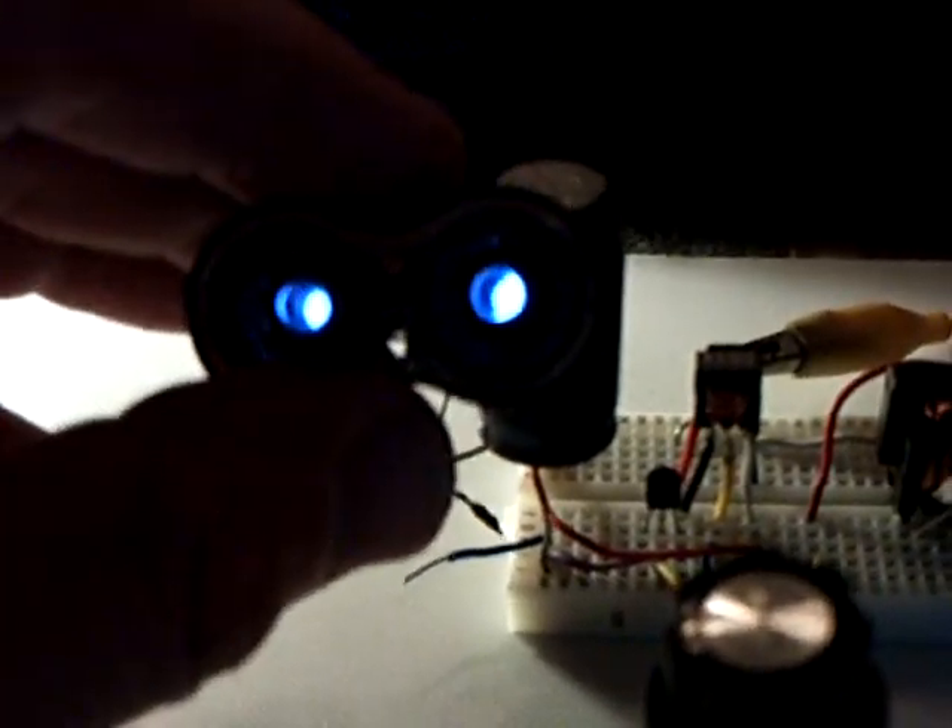You can see how they glow when I just get near stuff. So I just wanted to share with folks that you can make one of these circuits using a line filter — one of these line filters or one-to-one isolation transformers. It's not a perfect replication, but I do like the fact that you can put an LED on it and see the amp draw. You can see they get real bright or real dim, and that lets you know the power going through that transistor — the LED is a power indicator. Sometimes you have to tap this to get it going. If you leave it connected, it runs just fine; if it's disconnected, sometimes it comes on and goes off. Anyway, that's where I am with this project, folks. Thanks for watching.